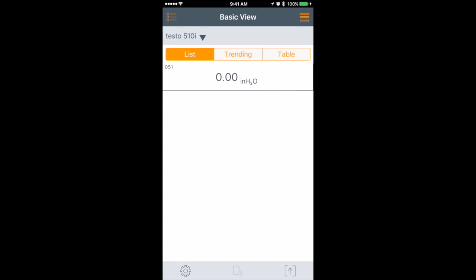If I go ahead and tie to the negative side or the minus side, we immediately start feeling a difference. The hose was kinked but now it's wide open and we're reading atmosphere. I sucked on the probe and it showed a pretty high negative — it's nice that it has that resolution. Switching to the positive side, blowing on it a little bit shows a change. Putting suction on the positive side shows negative, and putting positive pressure on the negative side also shows negative. That's your basic run through of the Testo 510i.